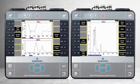When the machine goes through a natural frequency, the vibration level increases and you have a plot similar to the one bottom left. In this example, you see the machine go through two natural frequencies. In the phase plot above, you see the phase shift 180 degrees at the natural frequencies.